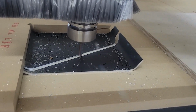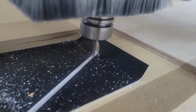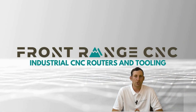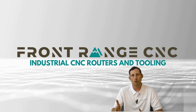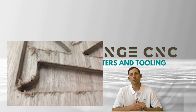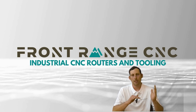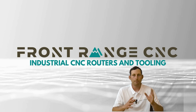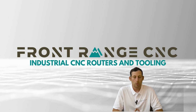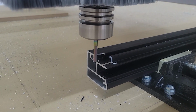A downside to an up flute style bit would be if you were cutting plywood, for example. There's a high chance that using an up style bit on plywood will tear that top edge. If you did use Baltic birch, you might be okay. But for the most part, as that bit starts to wear, it's working against that top edge, so to say. An up style bit would be really good in aluminum and plastic, simply because it will evacuate those chips and keep them from re-melting to themselves.